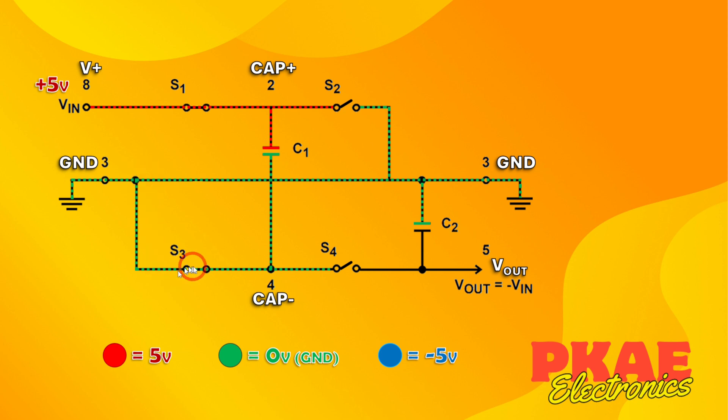All of the green path is tied to ground — there's a ground connection going through the closed switch — so that plate on the capacitor is at ground, and the other side is also at ground initially. With one side connected to ground and the other to 5 volts, the capacitor will charge very rapidly to 5 volts. Bear in mind the output capacitor's plate on this side is permanently tied to ground.